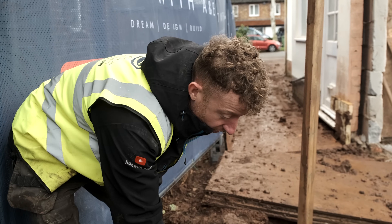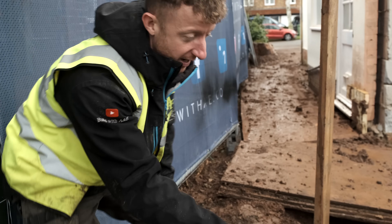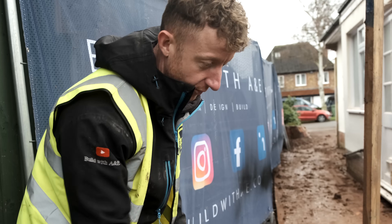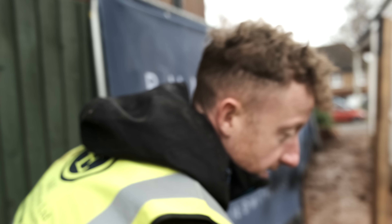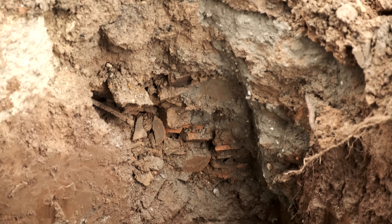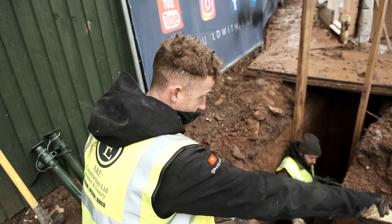By keeping it about a metre back from the corner we're preventing that happening. Now Joe's got that shored up, I can drag some more of this out with the digger and then we can start shoring this side up as well, because we're going to have to put our rebar in the footing over there to tie it all together. We need to make sure we're safe in this area because there is an old soak away down there, so the ground could be quite unstable. We'll do another one of these props about here and then we can still get in and get everything done safely.